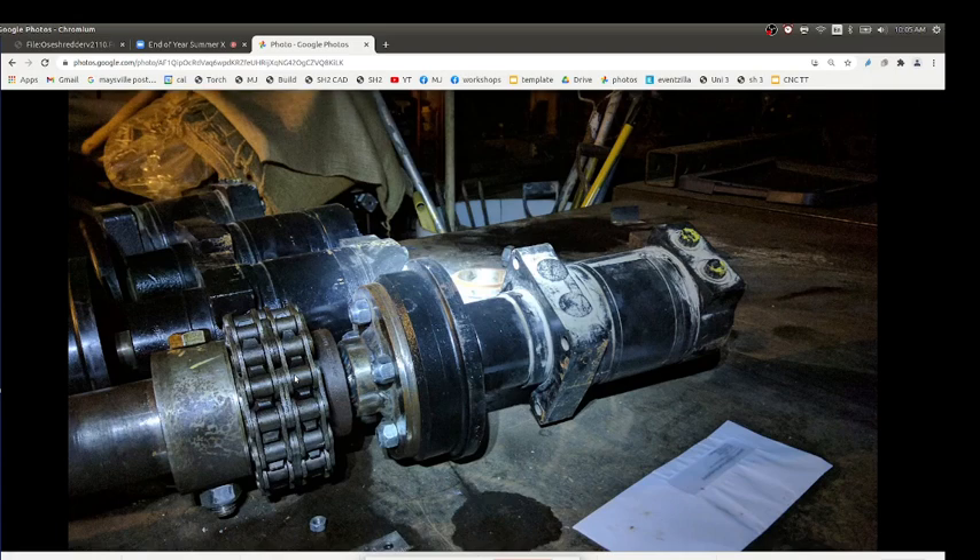It's comparable to a tractor coupler. The double chain coupler is super strong — holding many thousands of pounds while allowing for quite a bit of adjustment. There's a little play where the sprockets go into the chain, so while tight when you drive it, it can flex slightly. With the huge forces involved you don't wear things out — the play is there. A stiff coupler makes everything super tight; a flexible coupler is a nice idea to allow for misalignments and reduce wear on whatever you're spinning.